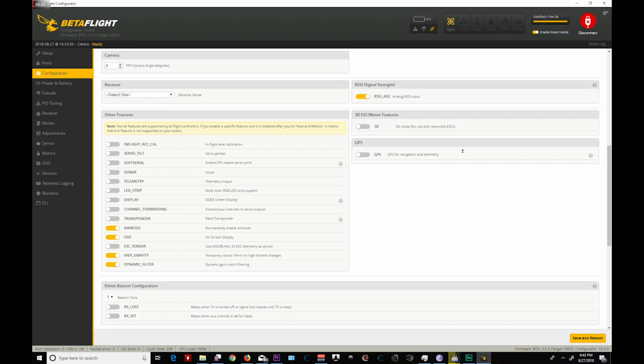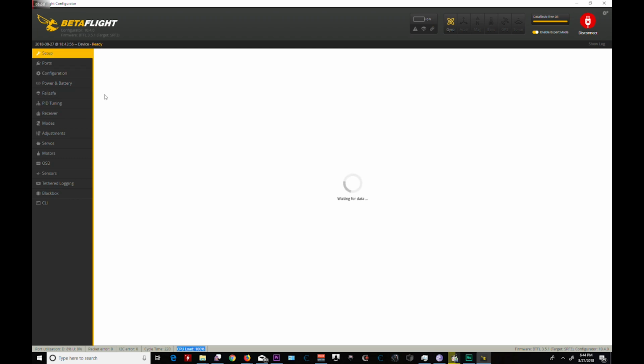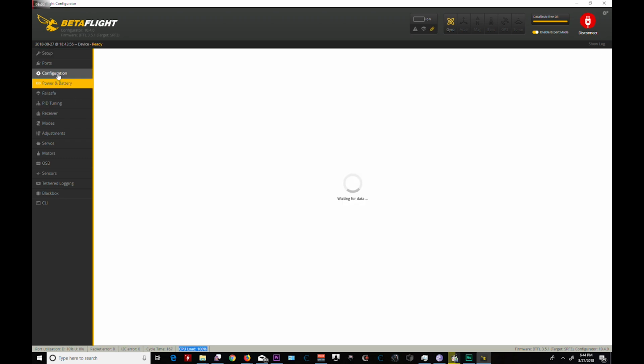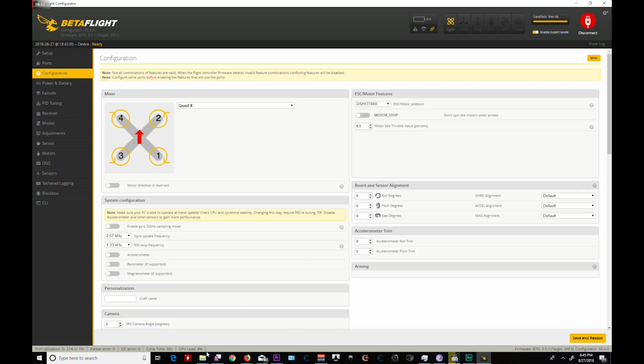Rebooting. Alright. Something I just learned about SP Racing F3 boards: you can't do 8K, 4K, because your CPU load goes to 100%. So don't do that. That's kind of funny. Oh, it really is 100%. That's funny. Okay, don't do 8K. But on the Omnibus F3, 8K, 4K, totally fine. I will back this down a bit. So now we're back to 9%. That's funny. Pretend that's 8K, 4K.